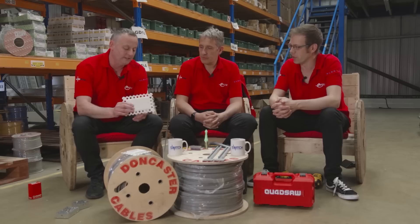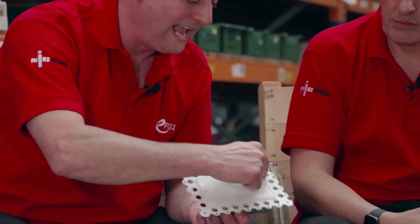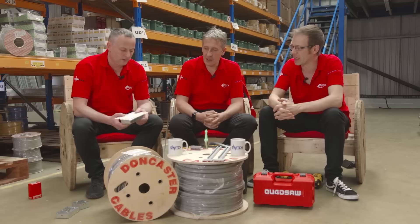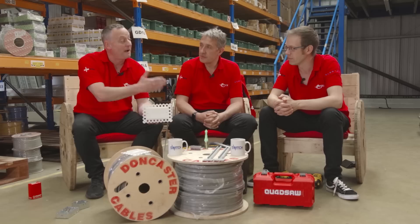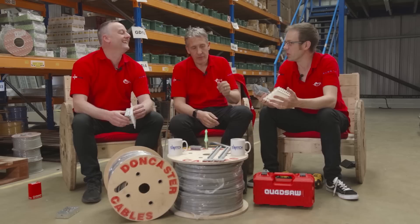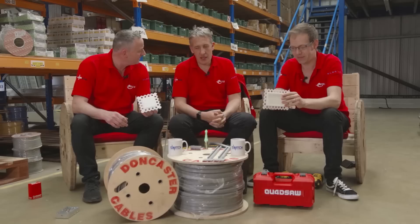It'll skim the wall complete, and then afterwards you just take a sharp knife and cut around the pre-formed edge. This part of the bead stays in situ, so you avoid that horrible situation where you gently tap plaster out to reveal the box and the wall caves in with a big gap around it. It also means cables identified at the box won't get cut shorter by other trades — this is like a peacemaking bit of equipment, contributing to peace and harmony on site.